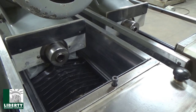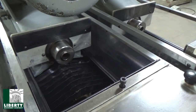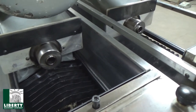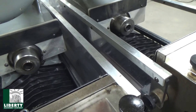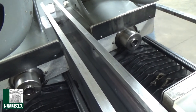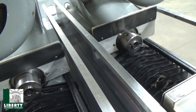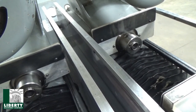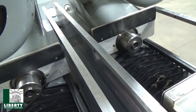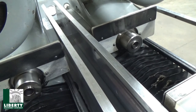That's 2,000. Sounds nice. I'm not going to run them long because we're not lubed up yet — I don't have all that set yet for the oil mist. I'm going to shut that one off and run number 4 right across from you. I'm going to fire it up at 1,000 still. There's 1,000 — pretty slow, but it sounds really nice. I'm going to stop it and go up to 2,000. I programmed 2,000 and spindle on. So this is just in manual mode — when I hit cycle start, they will go to their preset 1,000, 2,000, and 3,000. So you'll see 3,000 during the cycle.